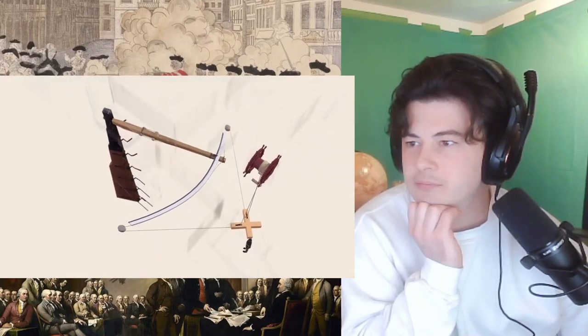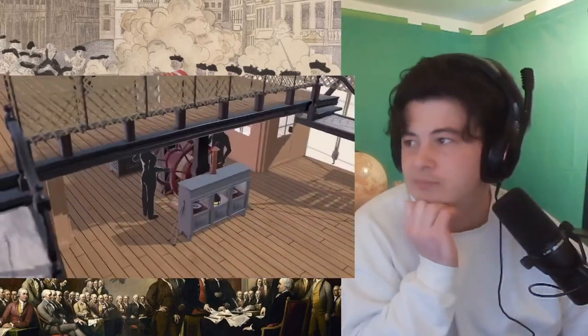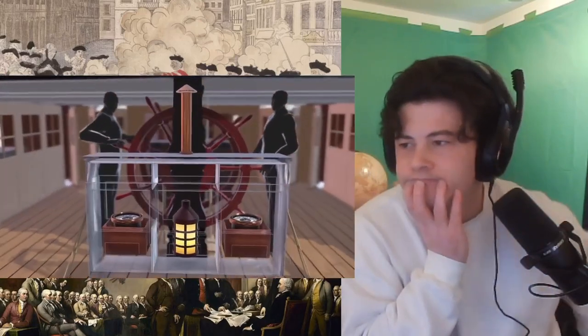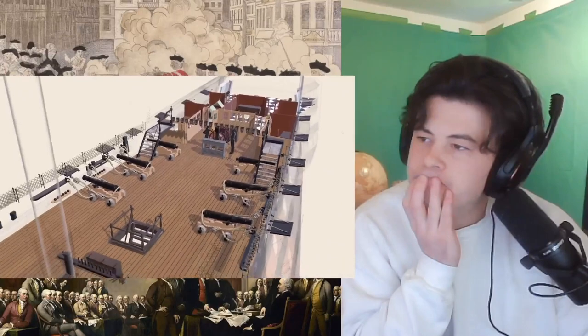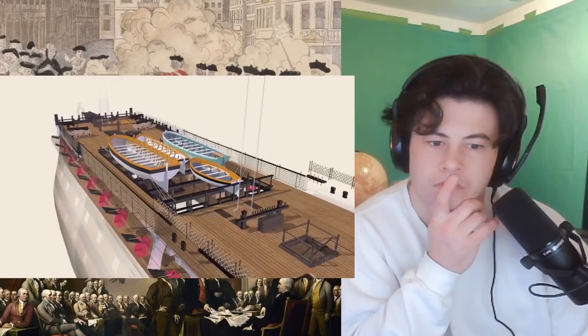As the wheel rotates, ropes move, guiding the tiller gracefully along its arc. The attached three-story tall rudder swings on metal hinges fastened tight to the keel. Focusing back to the quarterdeck, there's a binnacle in front of the ship's wheel which holds two compasses for redundancy, so the sailors on either side of the wheel may take accurate readings. A lamp sits at the center with a small chimney to let off lantern smoke. A row of fire buckets hangs from the poop deck beams above. Various 12-pounder guns line the sides. The center of the quarterdeck is open to the upper deck below, with skid beams and cradles to secure various onboard boats.